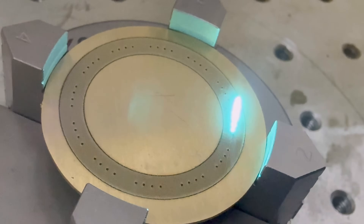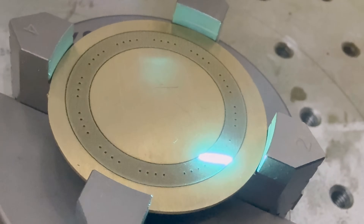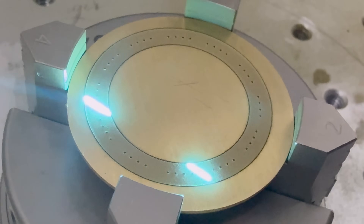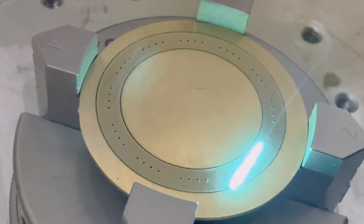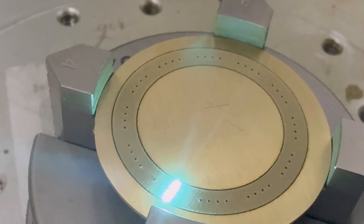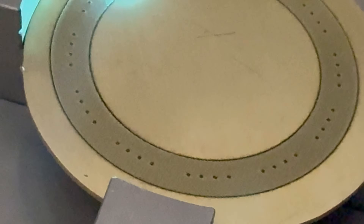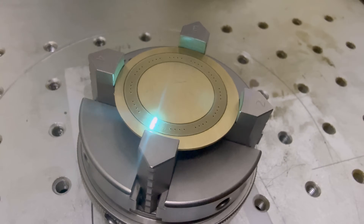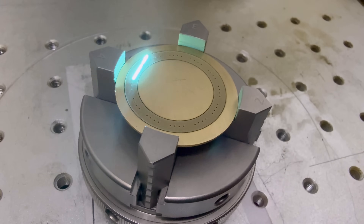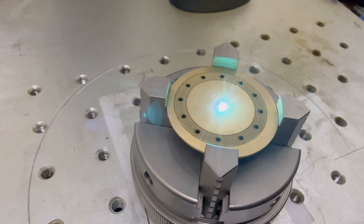Here on these scanning passes you can see it going through and making that outer chapter area. I'm changing the angle every time — that's going to make the pattern on the brass a bit smoother and less of a crosshatch pattern. I really recommend doing that; I usually change it by 12 degrees. Depending on what you're doing you may want that pattern, so you may have reason to keep it at a specific angle. What I'm doing here is called a crosshatch — going one way and then the opposite — and by shifting by 12 degrees I get a smoother result.